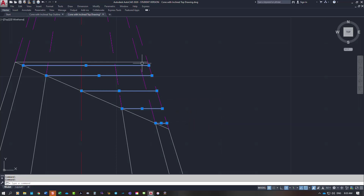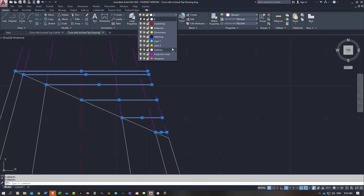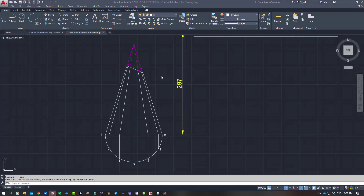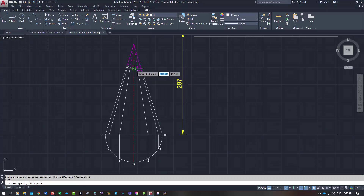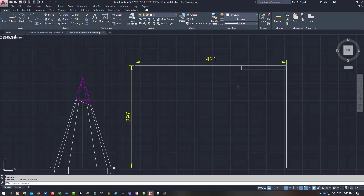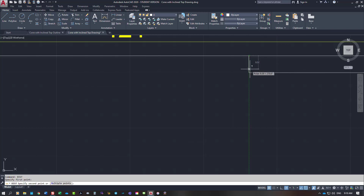I number the points around the base of the cone. I'm placing the joint line down the center line, so my joint line will be on number three. To position things on the sheet I've come in 125mm from the right-hand side of the sheet and down about 12mm from the top, giving me a start point to begin drawing the pattern.